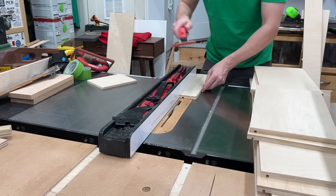The lateral stabilizer is the ZST686TU01 — there are several parts. One says 'R' for the right-hand side of the back slide, and 'L' for the left. On the back of the slide there's a little notch, and that's where this slides into place — kind of locks in, then snaps into place. The orange tab pushes all the way in to lock it. My slides are the 563 by 305B, so my gear rack length needs to be 13 and 1/32 inches long.